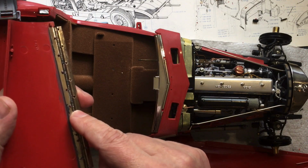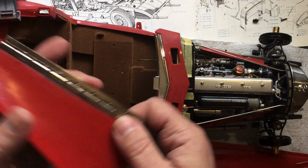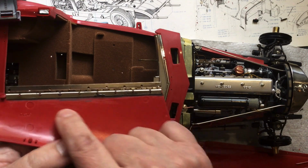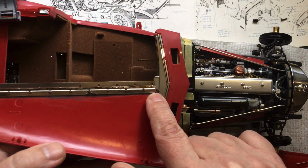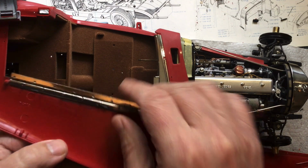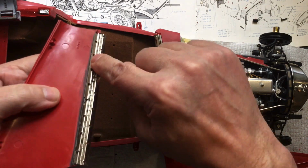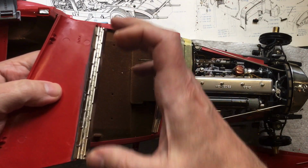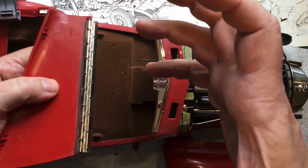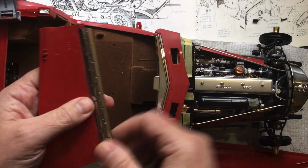If those start to break, which I'm sure they very easily could, then the hinge is going to start getting loose. So I also epoxied it on. I need to clean it up a little bit. I use JB Weld. I just put a very, very tiny amount on the edge, and to bond that on so all the little rivets will hold it in the correct position, and to secure it, the JB Weld will just strengthen that and make sure that, you know, nothing starts coming loose later on in the future.